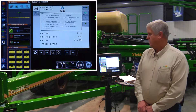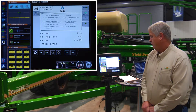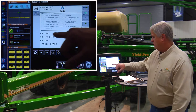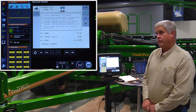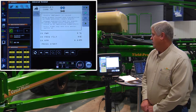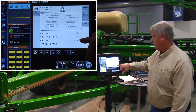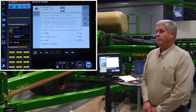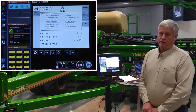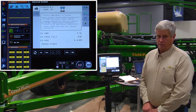As he starts the tractor up, he's going to engage the hydraulics. We're set at somewhere around 15% to 20% on the hydraulics. Once he engages that, our channel PWM is going to get up there around 26% to 28%. All meters should be turning at that point in time, and then once it starts turning, it's going to start opening up. Our channel RPM is going to be our meter RPM, and we're going to keep increasing the flow as it goes through that calibration process until we hit 38 to 40 meter RPM, which is our high-flow target. Then it will shut itself down, and then it's calibrated.